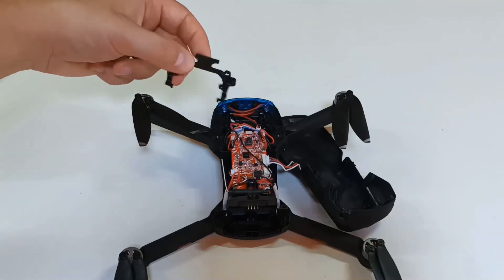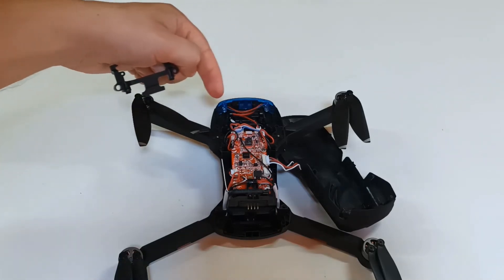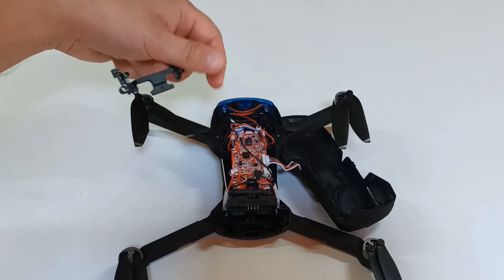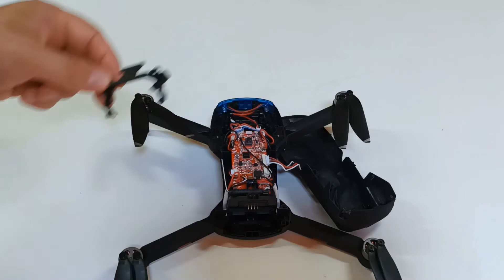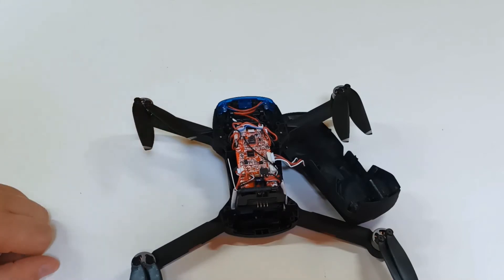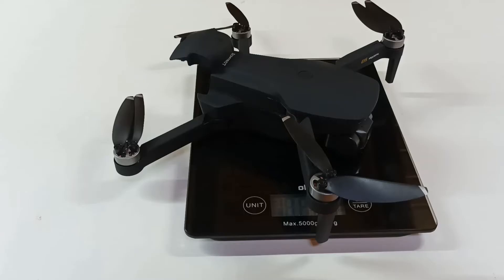From the front part of the drone I was able to remove this plastic piece. It was just covering the headlights of the drone and some connections of the camera with the drone body. When I removed it, I didn't see any change in how the camera casing was fixed inside the drone — there was no play. In general, the camera is fixed with rubber, no screws, which allows the camera to be more flexible and avoid vibrations. The rubber connections are pretty tight inside. This is how we can overcome this challenge by removing parts that are not crucial for the drone to reach the desired weight.